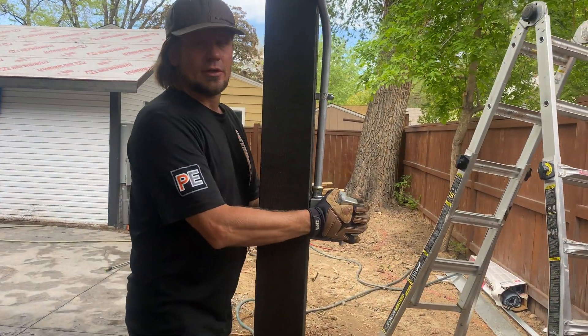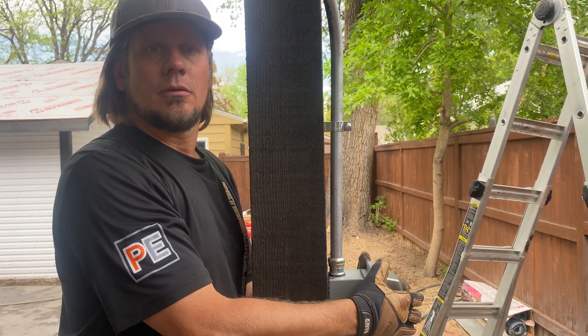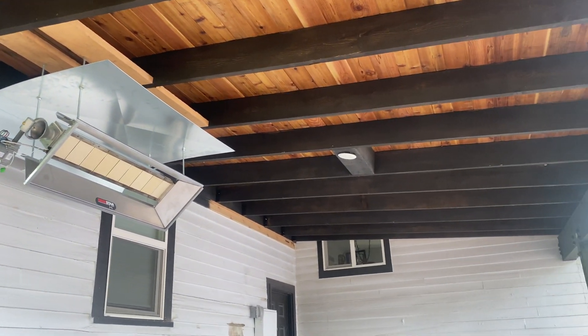Right here is a normal outlet but wet-rated GFI. Over there is another outlet. They wanted these on the back side — I didn't agree with that either, because they're putting a canvas here to keep the heat in for the heater. How are you going to get to the outlet? I felt like they could have been positioned more accessibly — nobody likes to look at electrical, so it's weird.